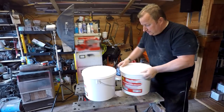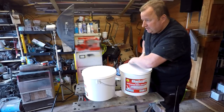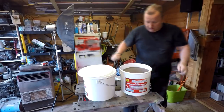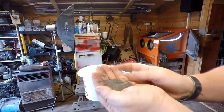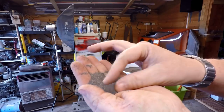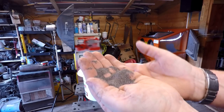Right, okay, that's out now. This new stuff is more of a grit — 60 to 80 grit — so it should do the job of removing rust no problem whatsoever. It's darker in color and has more of a gritty texture to it. It still looks pretty fine, but if you look at it under a microscope it's got very jagged edges, whereas the glass stuff would look more like a powder. This is what I'm hoping is going to be the best.